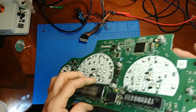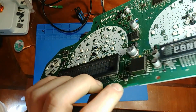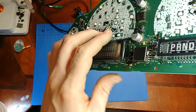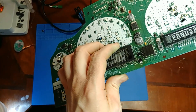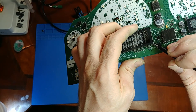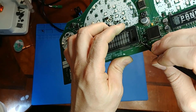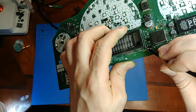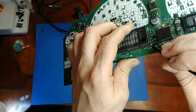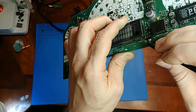I had to run a jumper that I wasn't able to get on camera - it just had to be held at such a funny angle to see. This extra unpopulated resistor - there are two resistors side by side here, both zero ohms just in parallel - but there was a sense feedback foil that got damaged, so I had to run a jumper.